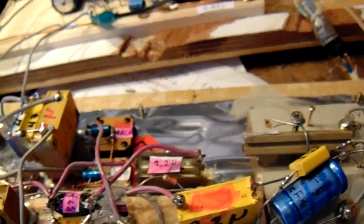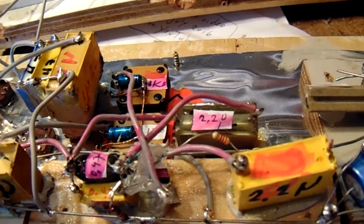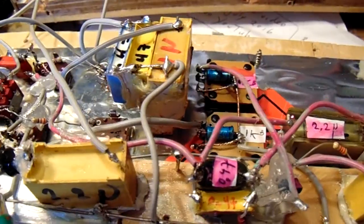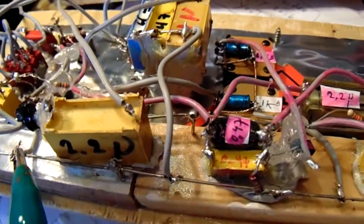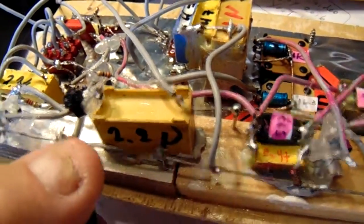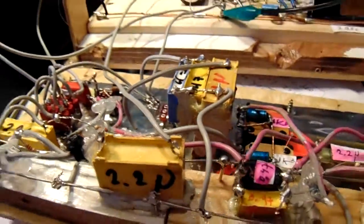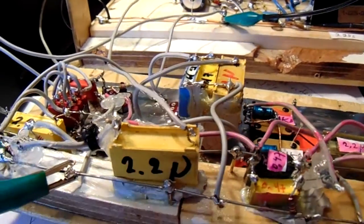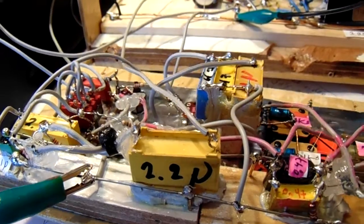Very interesting perhaps to show now how a ground loop sounds. That's a classical problem when you want to develop audio amplifiers — you make a ground loop. I've made it here for demonstration. And here you hear the ground loop. It's a kind of deep hum, and you can't compare that to a hum that has to do with shielding. Now I make the proper connection and the ground loop is gone. The amplifier is totally silent.